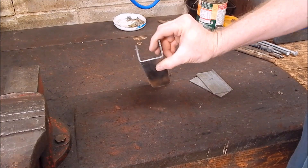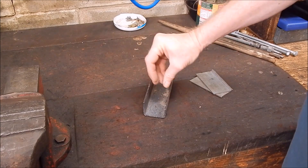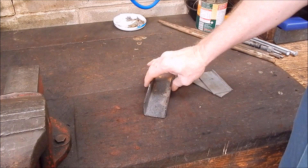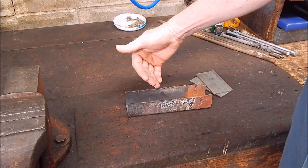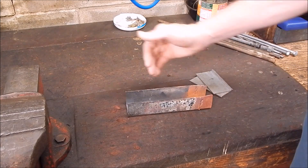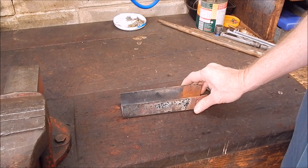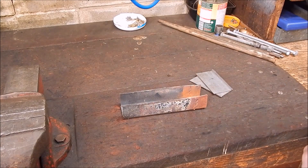You want to make sure the sides are not coming inwards. Sometimes on U-section they come inwards, sometimes they go outwards. If you're going to make a mould, the best way is to ensure there's a little bit of outward spread, and also a bit of slant outwards on your cut, to make sure that when the aluminium cools down and shrinks it will actually come out easily. You don't want to be trying to dig it out. So I'm going to make these sides not dead parallel — the theory is the aluminium will just drop straight out.